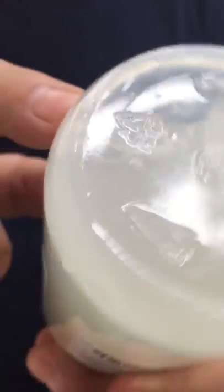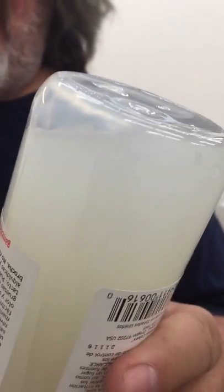The matting agent that's in there is wax, and sometimes you'll see that wax coagulates or hardens inside the bottom and settles out, especially in cold Canadian climates — it tends to just gel up in the bottom and sit there. So we need to dissolve that so that it gets activated within the jar itself.